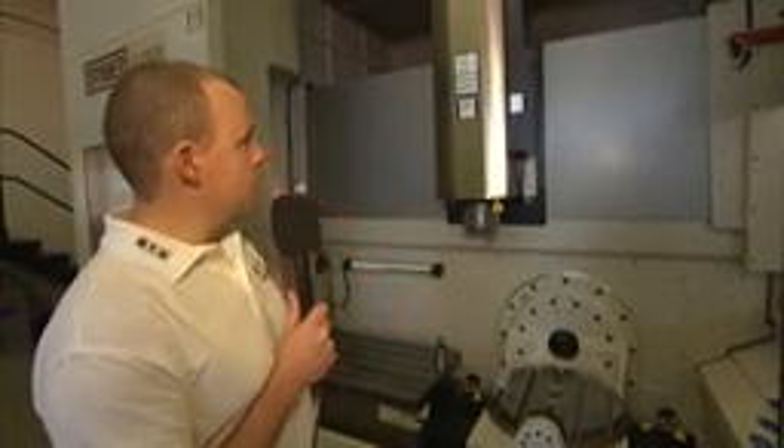This machine is actually available ex-stock. It comes with a standard 12,000 RPM spindle, a 55-station tool changer, and it's a BT40 spindle.